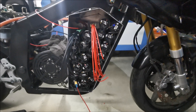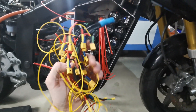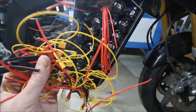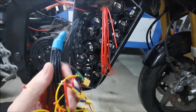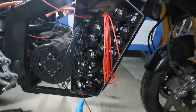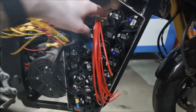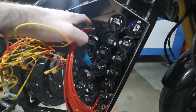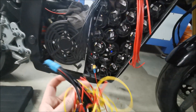It's been an eventful day, not in a particularly good way. This was my original attempt at wiring all this up, and the mistake I made was to pre-wire all the connectors and then think I could just crimp it all together into the joiner for the negative and into the lug for the positive — and that didn't end up working very well. I ended up with a mess.